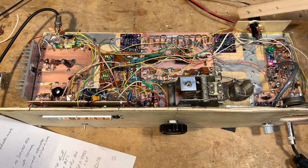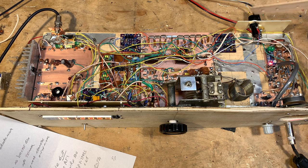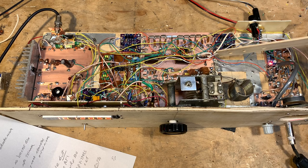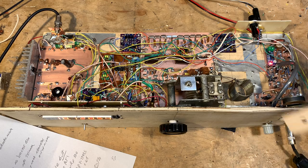I put in a fuse. Here comes the power in here — the fuse. And you see this little diode down here? That's a polarity protection diode. So if you ever put polarity in the wrong way — positive to the negative — suddenly this diode will conduct like crazy and blow the fuse. Reverse polarity protection — I began to sleep easier.